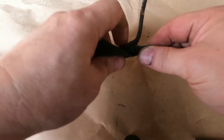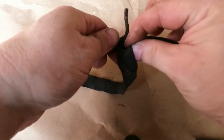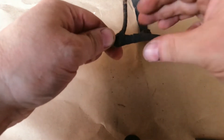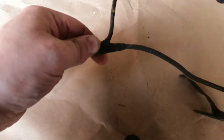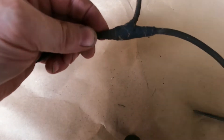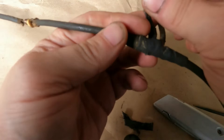So mainly when you're looking at a knob-and-tube system, you're looking for any wire that's not knob-and-tube. The wire has to be the exact same stuff. The knob-and-tube has to look like all the other knob-and-tube that goes into it.